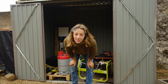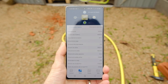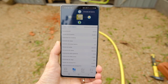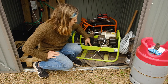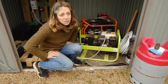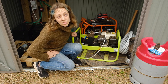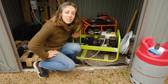Day 510 of rain — we're at 67% battery charge and it says we're charging at 0 watts, though the machine does say it's charging. We've also borrowed a smaller generator with an alternator, which we thought might produce a more regular output that the inverter could handle. But this generator didn't work either — the exact same symptoms, the inverter just didn't recognise it at all. Still no luck.